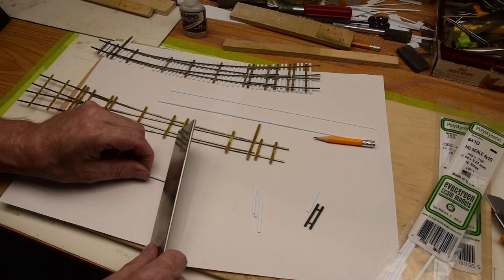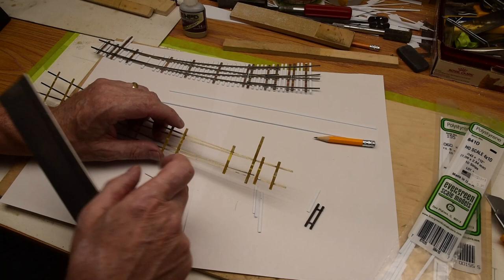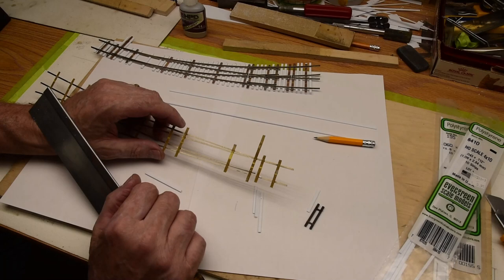Well, make sure that the bottom of the rail, like when you do any soldering as well, is sanded or filed, like roughed up on the surface. That way you get a really good solder and bond, right? The same as glue with any material. Put a texture on it, like a tooth on it, and it grabs really well.